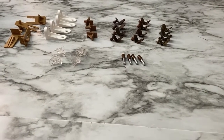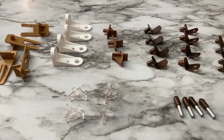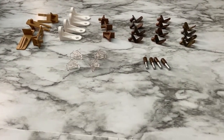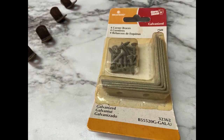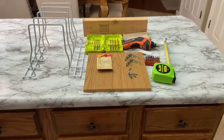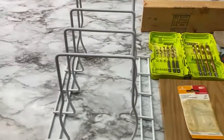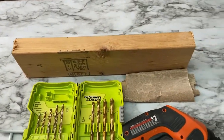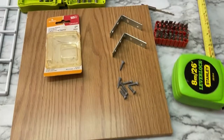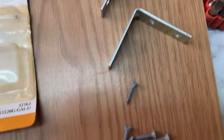There are many different clips you can find for adjustable shelving — some are plastic, some are metal, some have wider pegs than others, so you just have to work with different types and see what works best in your space, in your cabinetry, or for your shelving. Some of these pegs actually worked in my space, but I decided to go with the corner braces because I was going to use a larger piece of wood and wanted it to support heavier stoneware. Tools needed include a wire rack for your cookie sheets, cooling racks, and stoneware; a two-by-four to support the braces while screwing them in; sandpaper; a drill and drill bits; drill screwdriver bits; a tape measure; and four two-inch corner braces with screws to fit.